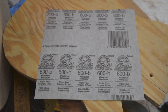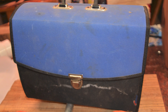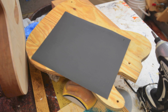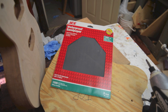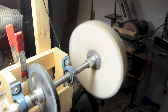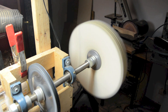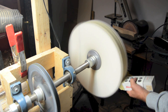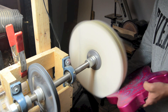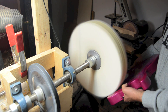For wet sanding I used silicon carbide sandpaper — I didn't film that process. Start with 600, and I've got all my sandpaper organized in a nice handy carry-on, all divided out. Move up to 1000, then up to 1500. Soak the sandpaper for about 24 hours and then come back and hit it. You can also buy some real high-end buffing pads from Lee Valley. After it's dried and wet-sanded, go back and buff it out using buffing compound.